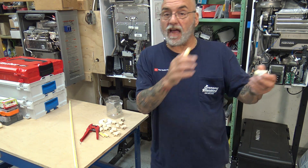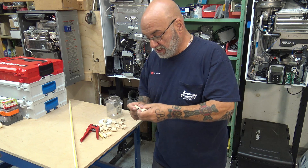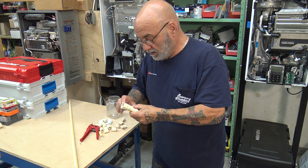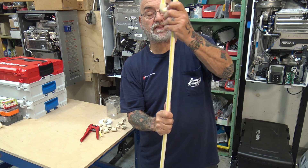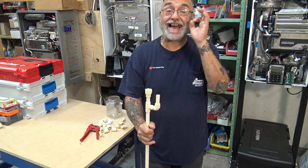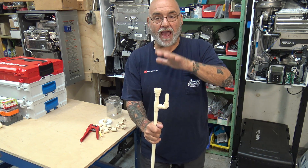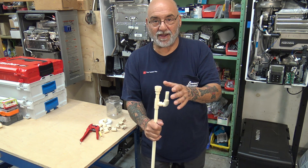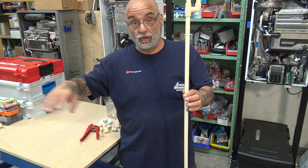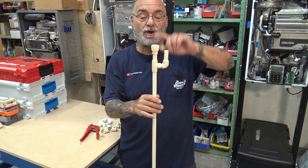We take one short piece, put it into the female adapter, add our T, a street elbow, another short piece, then our pipe. I'll show you how to cut the end. This is our drain — and it needs to be vented. I don't care how many years you've been on the job, you have to vent this thing or you'll get a hydro lock inside of it even though it's an open drain.